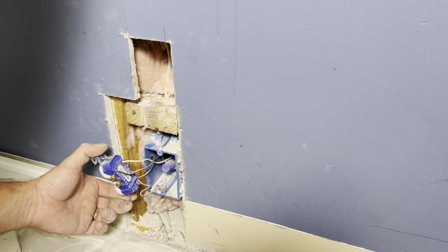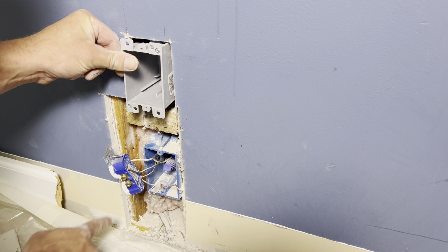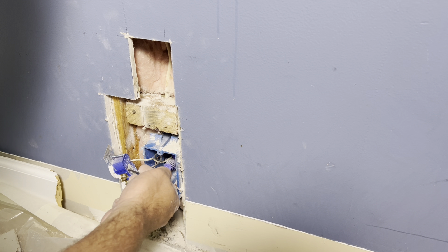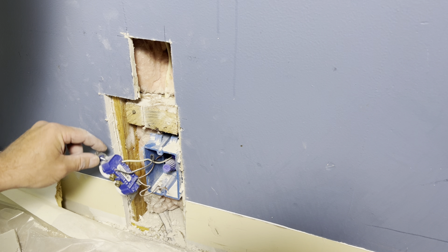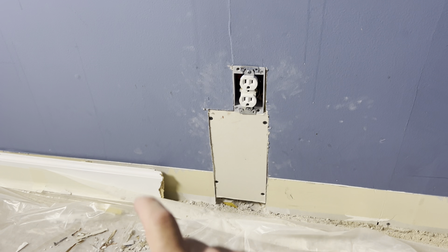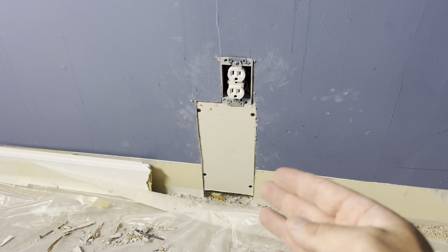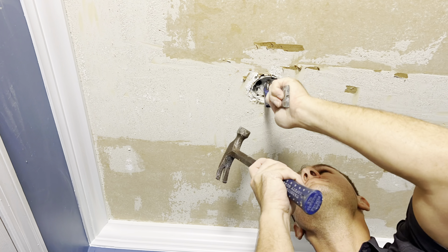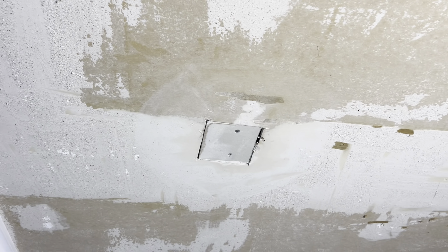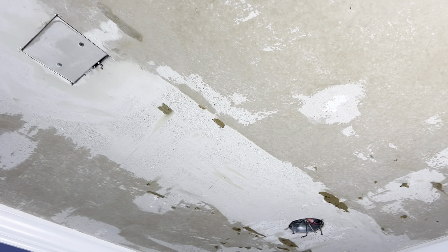Now I'm ready to take off this outlet. As you guys can see I've opened this up quite a bit. I've got a new box that's going to go in right there and tighten using the sheetrock, and then I'm going to replace this with a brand new piece of sheetrock. I need to take this electric wire out, pull it all the way up here, put it through the box, and then replace the sheetrock and put this back in. We got this outlet moved up and now we're ready to put some sheetrock on and finish it up with some baseboards. There is a little gap there but the baseboard is going to cover it. The last opening was up in the ceiling — we got that cut out and filled in with sheetrock and now it's also ready for some mud. Let me get to mixing some mud and fixing the ceiling and all the sheetrock repairs.